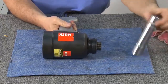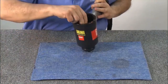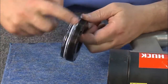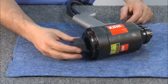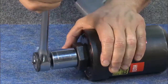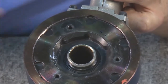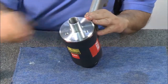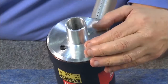Remove the bullet. Next, reinsert the dump valve, making sure that the flat is at the rear of the tool. Grease the seals on the back cap before reinstalling, then replace the back cap. Insert the rear wrench and, using a ratchet, thread the back cap into place until it bottoms. Then back it out until it reaches the nearest scallop notch. Insert the locator. Now align the back cap and screw into place, then tighten the screws.